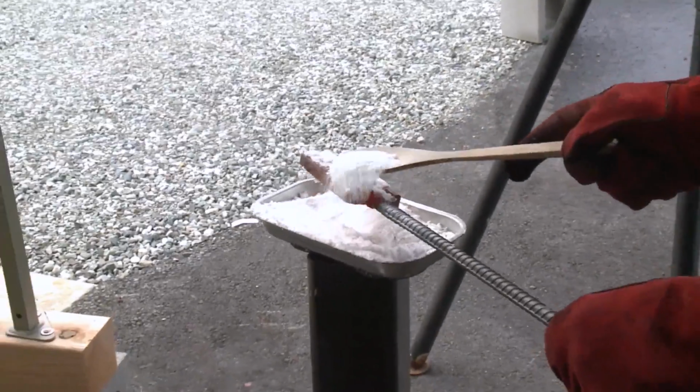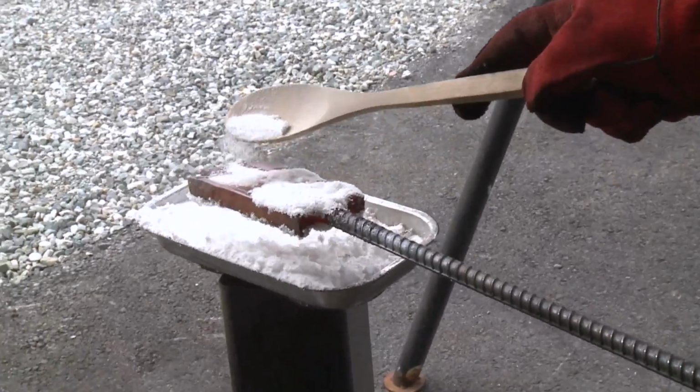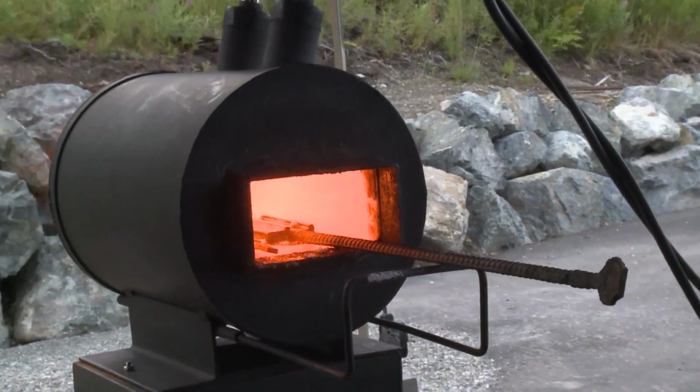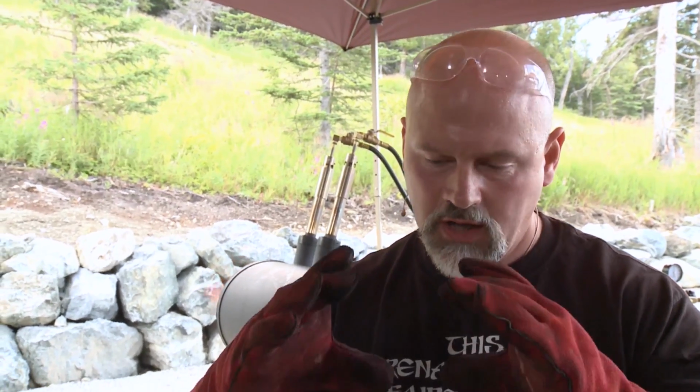The old saying goes, you want to reinforce these welds really slowly. I say slowly, slowly, catchy monkey. So we want to go, put that in there, and the next round we'll go to the press and we'll see if we can't compress that down just a little bit more to get the weld completely set. Don't need a press. I can just continue doing hammers. But if I went to the anvil next, instead of going to the press, what I'd start doing is I'd start increasing the strength of my blows to reinforce those welds even more and begin to draw it out.